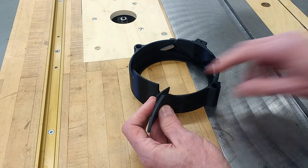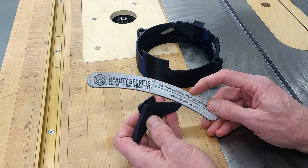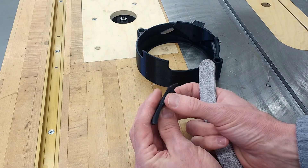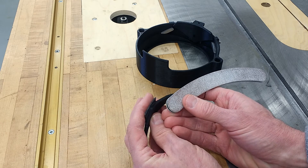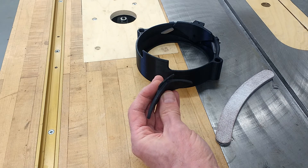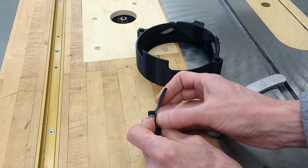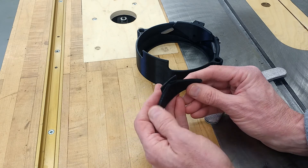Here's a tip for sanding: start with a nail file — coarse side first until all your ridges are gone, then move to the medium side. Then work your way up to 220 and maybe 320 or 400 grit sandpaper. When you're done it'll probably still be a little fuzzy on that surface. Take a soft cotton cloth and rub hard and fast — that'll burnish the surface and smooth it out. That's key; make sure to try to smooth that out and it'll help you quite a bit.